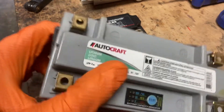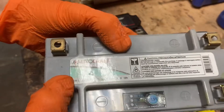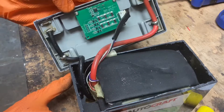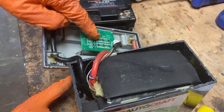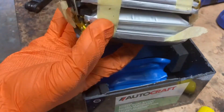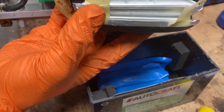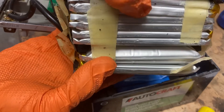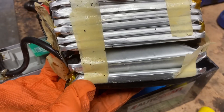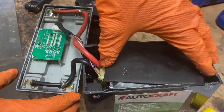This one right here I've already opened up. It simply says lithium, and that could be a whole lot of different things. So I opened this one up to see what it was made of, had to cut it open, and we got a BMS here. This one happens to have LiPo cells in it — lithium polymer. You can see all these cells look relatively normal, and we have one cell that is clearly bad there. That is probably why this battery was recycled and no longer works.